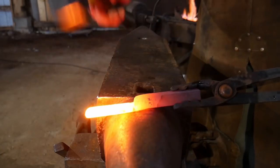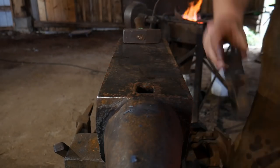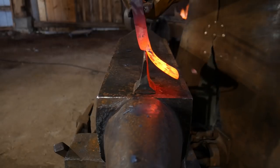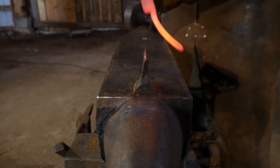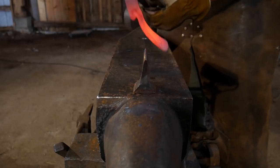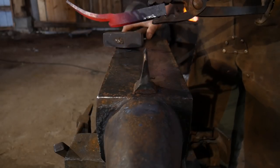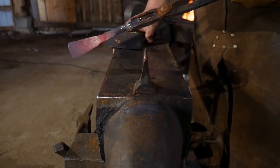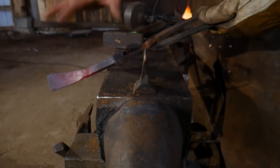We're going to give ourselves a little bit of a courtesy bend here out of the way — nice and close, don't have to bend it too far. We want it to be nice and close to the shoulder. Then we're going to take our hot cut hardy, put it up in the anvil's hardy hole. And with that nice shouldered bend, we will come right here and drive that material straight down to separate ourselves out a mouth of material. We'll refine that mouth better later, but we just want to separate that out right now. Once you get that step portion done, that side is effectively done for the rough forging, and we're ready to move on to the other portion.